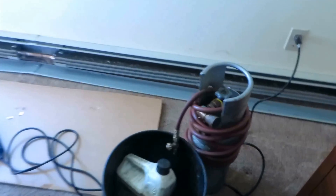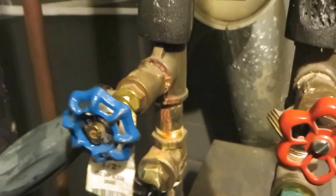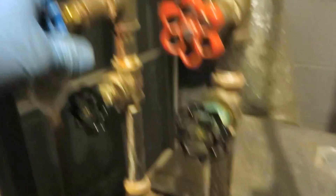All right, the water is back on. The ceiling leaked a bit. Purging the air up — I got the zone valves opened up, all three of them, and I'm purging the air here. I'll do all three zones.